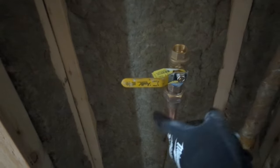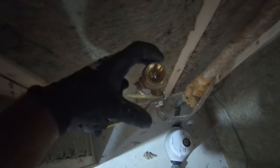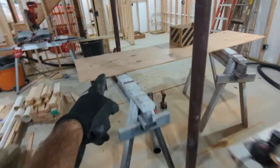To open the valve, we've got to take water pressure off, so we have to go out to the road and turn the pressure off. But if the pressure's being turned off, then our next biggest size, from this shoulder to there, is like a 3 inch hole. But if I spin the valve off of this hex, the 2 inch hole will clear that hex. And so I made the 2 inch hole. So we will be turning off the water at the street, spinning the valve off, weaseling this sheet in with this big hole in it, trying to go over this way enough and slip up onto that enough to slide back down into place and mount it, and then come back and put the valve back on and go back out to the road and turn the water on.